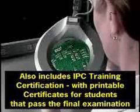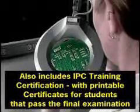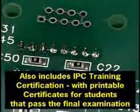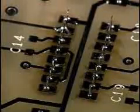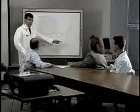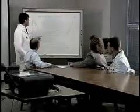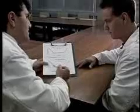Another aspect to the no-clean process is that the final inspection criteria may have to be changed. Some flux residue will remain on the board after soldering. Decisions have to be made about how much residue will be acceptable. The critical issue is not whether residue is present, but what the effects of the residue will be on the long-term reliability of the board. The engineering staff at your facility should be testing and evaluating this issue.